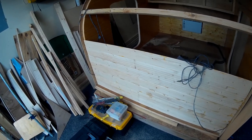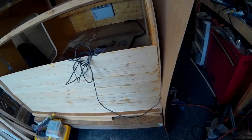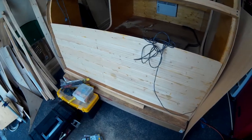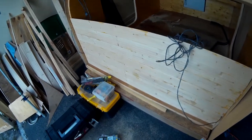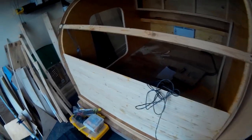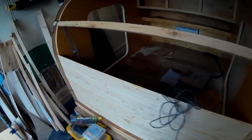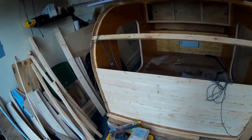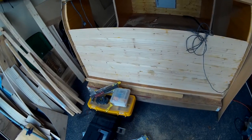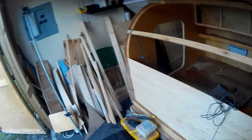Use a few nails — a nail gun, a staple gun for thin wood, or small brads. These nails don't add a lot of structural support; they mainly hold it while the glue dries. You could virtually assemble this entire trailer with glue alone and feel just as good about it on the road, because the glue really holds well — in many cases the bond is much stronger than the wood itself.